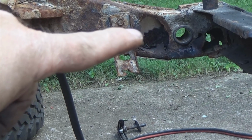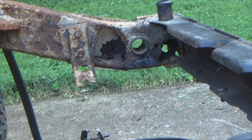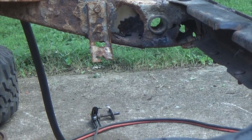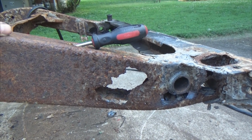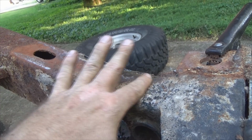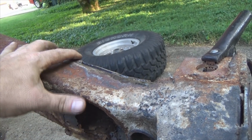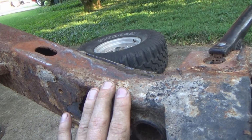Right there is a stainless steel plate that's welded in. I got to cut the top of that mess off and get ready to patch that in. But nonetheless, let's get to work on the metal prep. I took the tip of the plasma cutter and came through and shaved the top of that weld off, saved me some grinding time. Now come back with a grinder and dress that weld up, got it down flush.